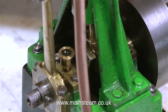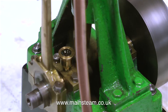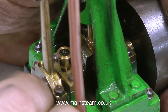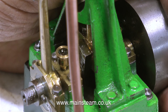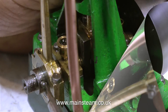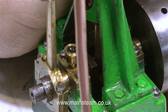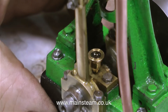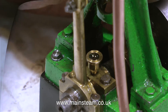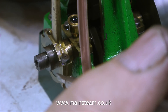There is quite a chasm — like a Grand Canyon — between model engineering and engineering on full-size steam engines. I was watching an engineer doing just that the other day, applying full-size techniques to a model engine. I'm not going to go into specific details but it made me cringe watching him work. With the help of the newly fitted grub screw I'm going to set the engine's timing. Up to a point this is more of an art than a science. As a general rule you need to start with the highest point of the eccentric at 90 degrees to the crank web, and depending which side of the crank web the eccentric is set to 90 degrees depends in which direction the engine rotates.